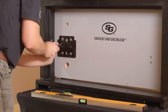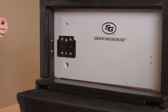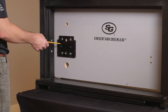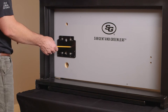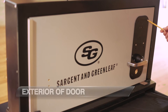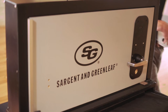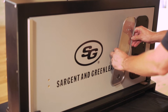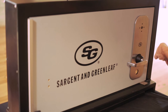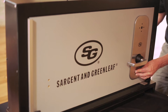Place a tabbed washer in each of the four mounting holes with the small tab in the adjuster slot. Install the four screws loosely through the door to the exterior mounting plate assembly. Once the interior mounting plate is installed, level the interior and exterior mounting plates. Once the level is confirmed, tighten down the mounting screws. Install your spindle through the spindle hole. On the interior mounting plate, punch and drill two additional mounting holes, and do the same on the exterior. Install your escutcheon plate on the exterior. If you have an optional rim cylinder, install it now — note this is not included with the standard 2890B 500 series installation.